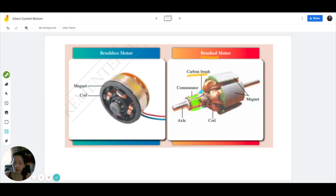Now one of the problems of a brushed motor is that it requires continuous contact between the carbon brush and the commutator. If the motor spins very very quickly, the faster it spins the more friction that's going to be generated between the carbon brush and the commutator. For one, it would generate a lot of heat, which is wasted energy. Secondly, if the motor spins too quickly, it can actually create sparks. Thirdly, it wears out more quickly.